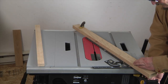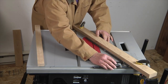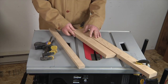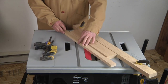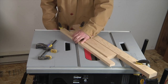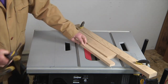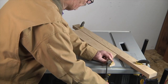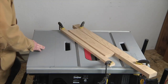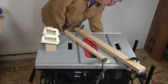You might need to use a scrap of wood between the top of the saw table and the rip fence rail to get a more secure clamping action. One more time, I'll check that my fence angle is exactly the same as the protractor. Here's my workpiece, which I've cut and milled nice and straight and smooth. I'm going to lightly press the secondary fence against it — this fence isn't absolutely necessary, but it helps keep the workpiece from wandering away from the primary fence, which can ruin the smoothness of the cove profile. You just don't want to clamp it too tightly against the workpiece, which would prevent it from sliding smoothly. Once this fence is clamped in place, test it to make sure the workpiece slides all the way through the cut with no effort.